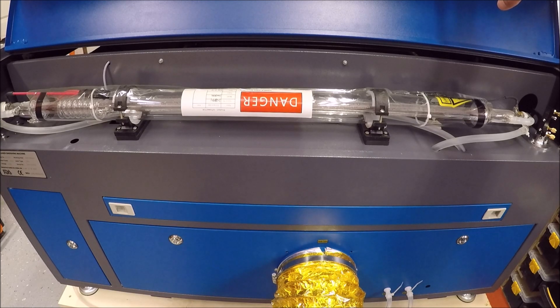If you're new to laser cutters like I am, you may not realize these laser tubes get really, really hot. To dissipate the heat, you pump water through the tube, and that water maintains the life of the tube. When I first got this I hooked up the pump and started pumping water through it, checking all the connections. All the tubes bring water in and take it out, and nothing leaked — everything looked really good.